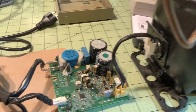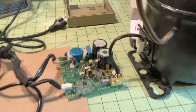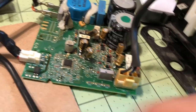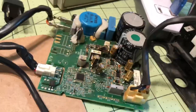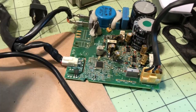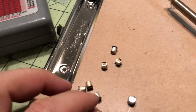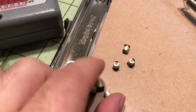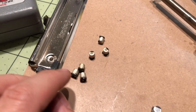There's an inverter for a three-phase compressor — it's a VCC3 inverter. I replaced it; it was defective, the compressor would not turn on, and I was able to repair it by replacing these capacitors — six electrolytic capacitors. The ones I replaced were surface mount, these six right here, and all of them were 33 microfarad at 25 volts.